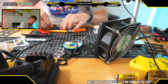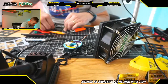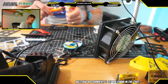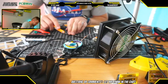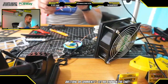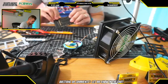So here we go. The downside to this is, unfortunately, you always lose at least one pin while doing this. I really wish they made female breakaway headers, because they do also make male breakaway headers, but what can you do? All right, I'm going to cut this off here like this. Okay, snap it off, and then start to solder these female header pins.